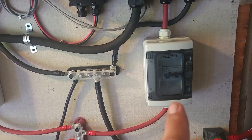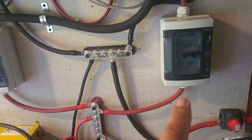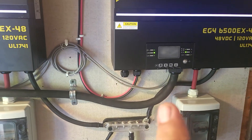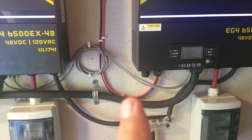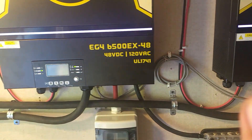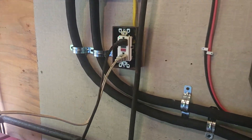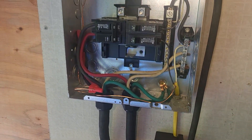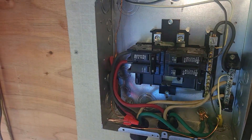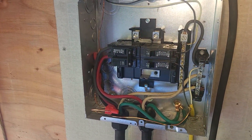The battery disconnect is here, and this is a DC fuse by Nader — it came with the system as a package. I'm running 2-aught wire into the system. Coming out of the inverters, I have this really heavy jacketed wire called pendant wire. It's pretty rugged — meant to be free-hanging for long distances. Inside there are four conductors and each conductor is 4-gauge wire. I've got two runs of that coming into the breaker panel, with the hot lines coming in to a 60-amp double-pole breaker to create a 240-volt panel system.